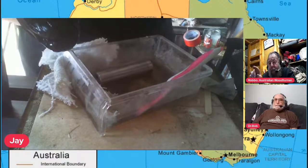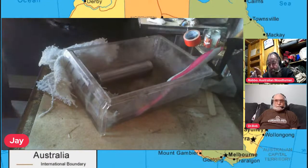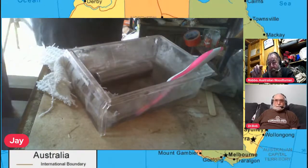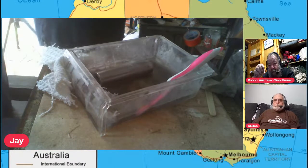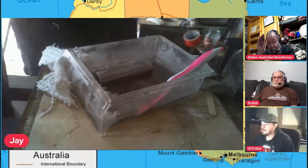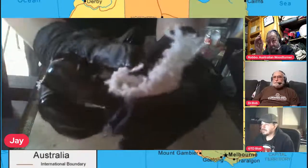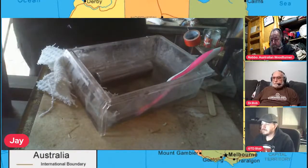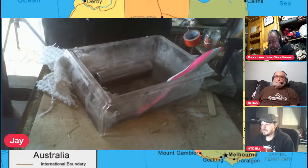What I'd suggest you do is dry that off, and then go over to your grinder and grind a little bit of a chamfer around that end, all right? You want it to kind of curve in on the ends. Just a small chamfer, that's all it needs.